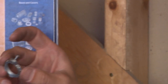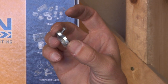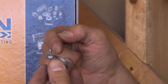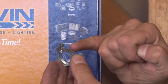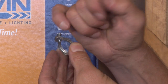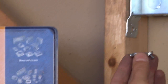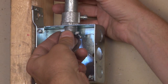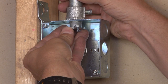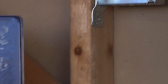However, there are times that grounding is required inside of a box and you don't have the appropriate ground terminations inside the box. Often this requires a grounding lock nut. As you can see here, it has an extra threaded tab with a screw so that a ground wire can be wrapped around and tightened down when it's tightened on the connector. It mounts the same way as a typical locking nut, but the ground screw sticks out to accept your ground wire and secure the application.